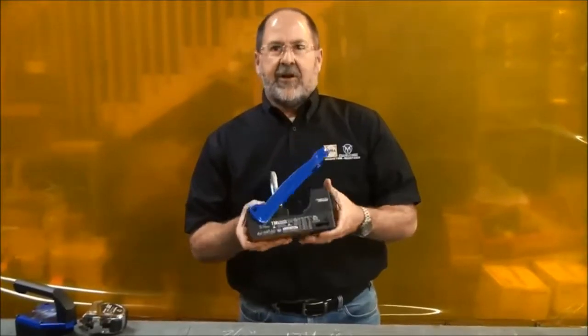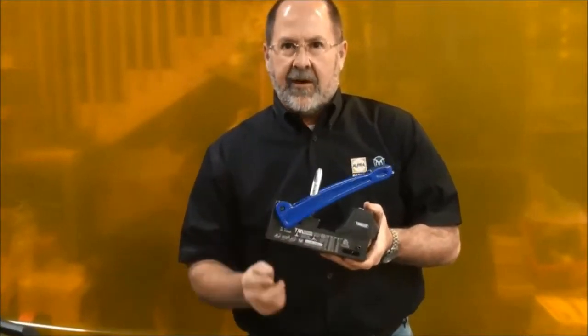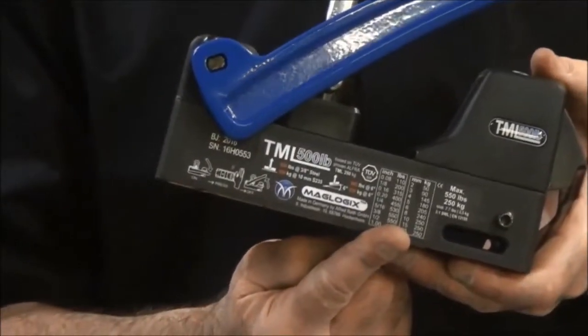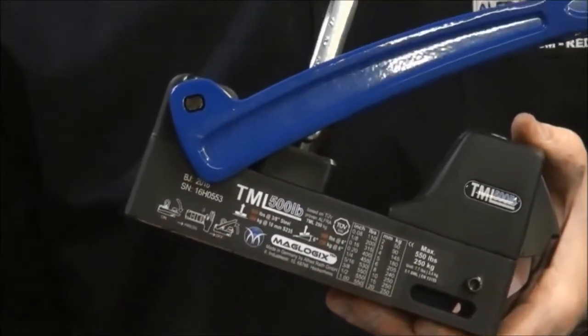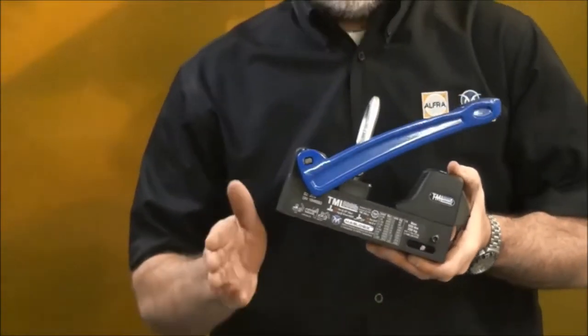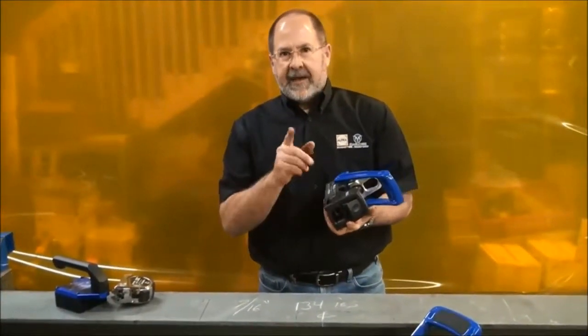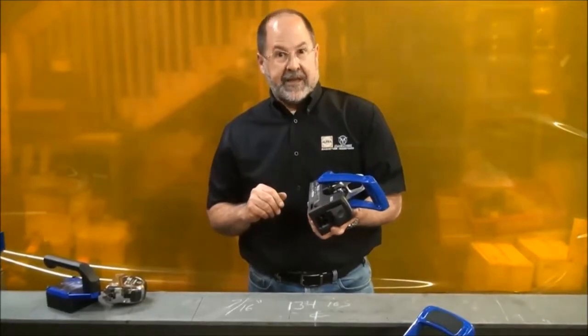When you look at the sides of these magnets, you notice the most important thing you need to know: how good is that magnet in your hands on what thickness of steel. On a piece of steel that's a quarter-inch thick, our magnet is about 90% of full power. The magnet they were using was about 30% of full power.